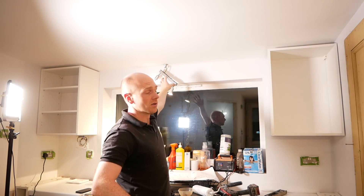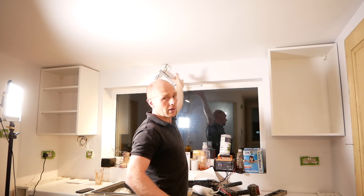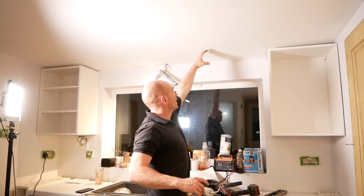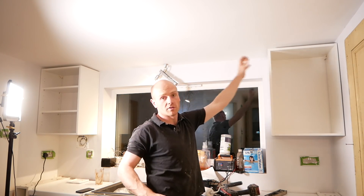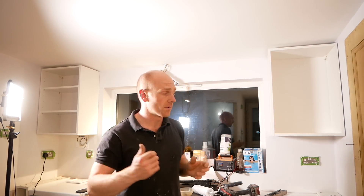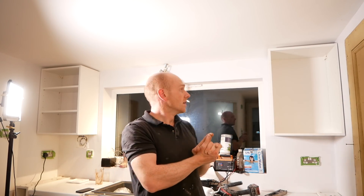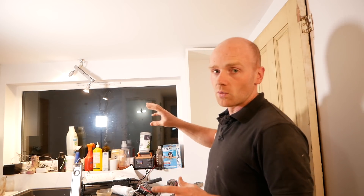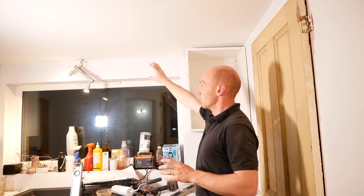There we go — it's not pretty but we've got both cabinets up. Up here we'll have a sort of bulkhead built across — a bit like you might have over a cooker hood — about 100mm deep with a trim piece joining the two over the top and some downlights set in it. If we do all that in some nice timber made up in the workshop, spray it and paint it all the same, I think it could look quite nice even though the bones of it are rather basic. And of course I painted before I put them up, because the last thing you want is masking brand new cabinets to paint. There may be a little bit of touch-up work around them, but ceiling and surrounding paintwork are done. We'll be tiling underneath once the worktop is in.